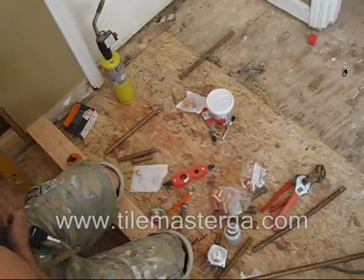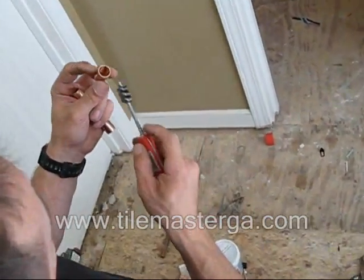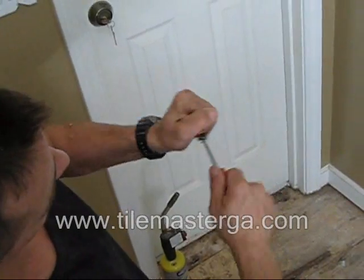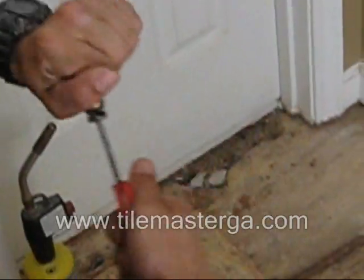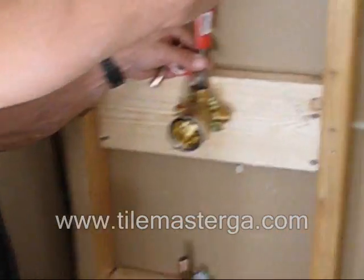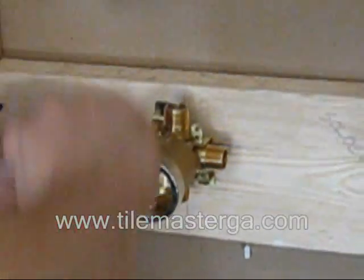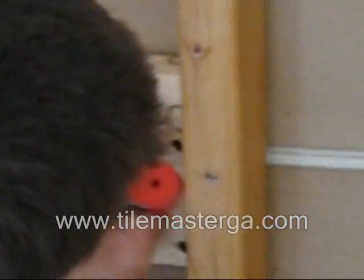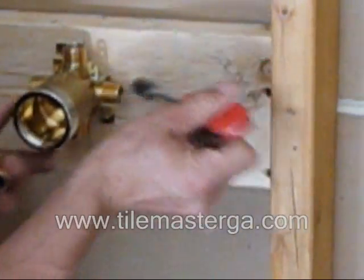For the inside we have a different brush, this type of brush. All the fittings that will go on later have to be cleaned as well. Sometimes they might look clean, but they always have to be double cleaned. So this goes inside. We're making sure that the first coat was removed. We're doing this with all the pipes that we're going to use here. We're making solid joints in here, so this one is also to clean inside. This pipe later will go in here and we're going to connect those. We're making sure that this is as clean as possible.